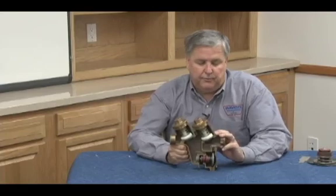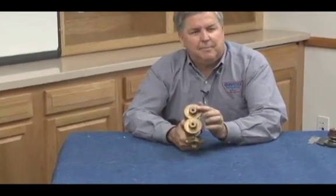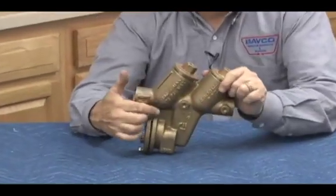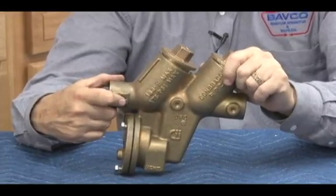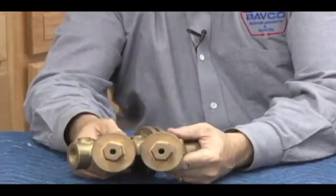So here's the small, meaning 3/4 through 2-inch, 40-200 series. First thing I want to show you is the covers. Some of them you may see tapped like this, and this is where our test cocks may be located. A lot of them you'll see where it's drilled on the side of the body here and over here where the test cocks go in also. Can make a difference on the workings of the assembly. Obviously on the side is not as critical as the ones that are on the cover.